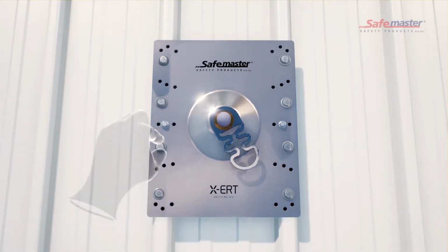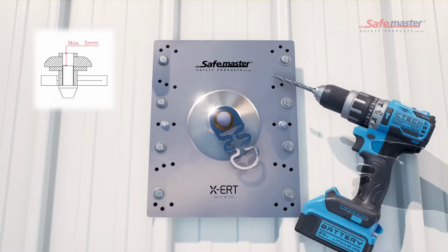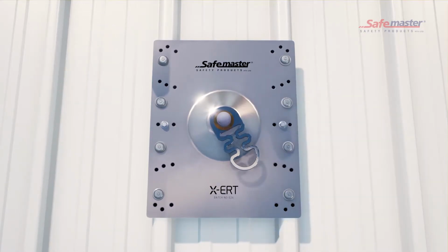Confirm all rivets are secured. Check that the crosspoint bulb-tight rivet stem is no more than 5mm below or above the rivet head. If the stem is outside these parameters, drill the rivet out and install a new one.